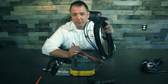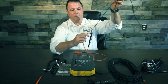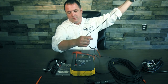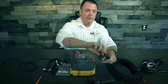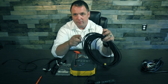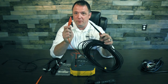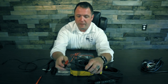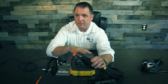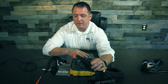To reach further, we sell 50 and 75 foot leads. Simply remove the short black lead and plug in the 75-foot cable — now you have the reach you need. Whenever you change cables and introduce a new cable to the ESA, put the two cable ends together, go into the point-to-point function, select ground wire, and zero the cables out to account for the cable's own resistance. Then take your measurements for ground wire resistance and leakages.